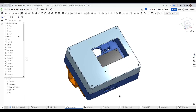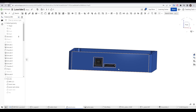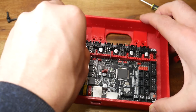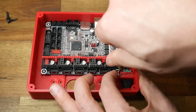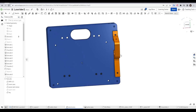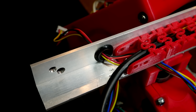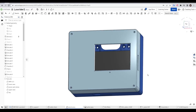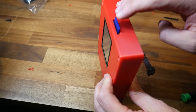The lower half of the new case passes wires through the bottom instead of the back, which is neater. The ports actually line up for the mainboard USB and SD card, and the power input is in the back with a clamp for the supplied adapter. I made up a new short power cable with properly crimped connectors — the barrel jack adapter has a nice place to sit and is held in place by a small retaining clip. On the underside there's a leg designed to slide over the aluminium profile and hold the case on a slight angle, with four potential mounting spots for flexibility. I ran the X-axis stepper cable through a grommet, slid on the mounting legs, and bolted the lower half in place.